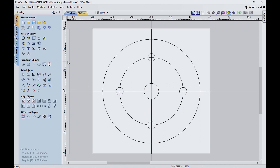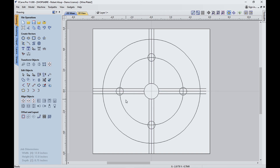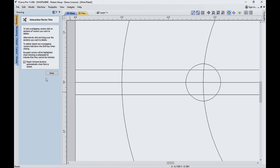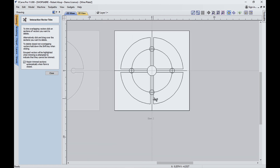So that's our holes and we need two other features — we need some lines here. Let's go to offset, pick that geometry, and we're going to offset both sides a quarter inch, then hit offset. Now all we really have to do is start cleaning up our geometry. So I'll take the scissor tool and clean this, this, this, and this, and that'll give me a square corner there. Let's do that on all four sides. Okay, we've got that done. Now let's go into the center and just click away things we don't need.